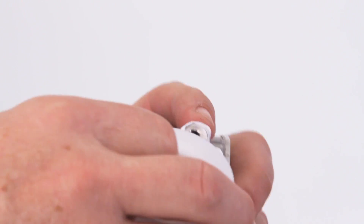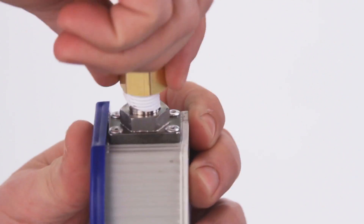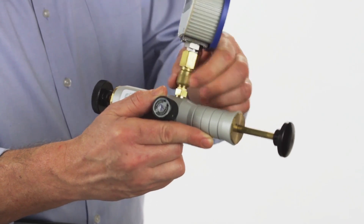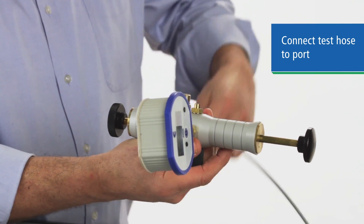For tool-less use, you first have to connect a Ralston Quick Test Adapter to your gauge. If you're using NPT, use two turns of thread sealant and a crush washer or bonded seal for BSPP. Now remove the cap on the fitting and attach the hose. Again, with Quick Test Connections, no tools or sealants are needed.